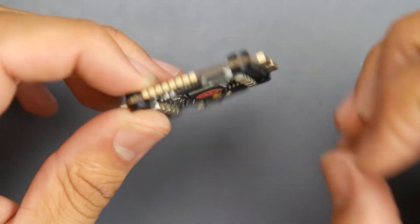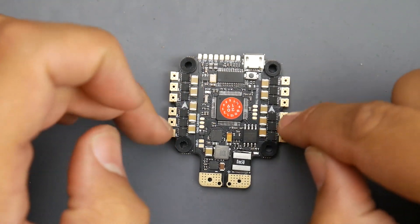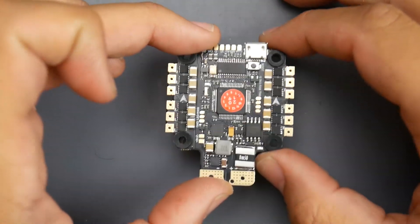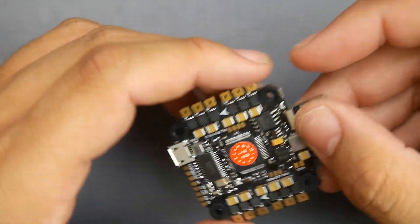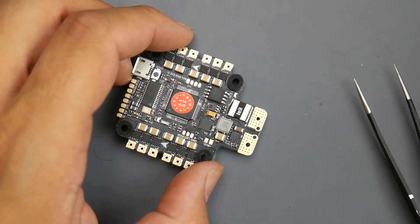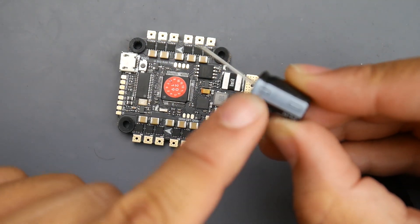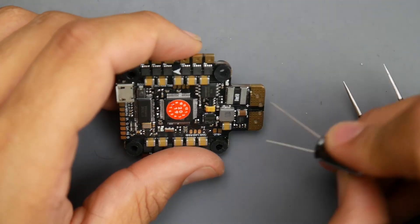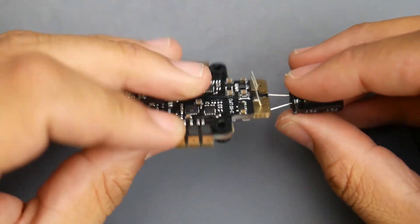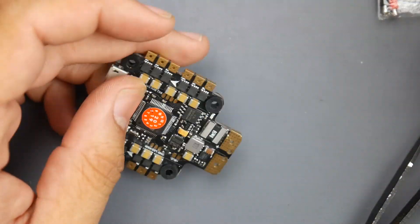It is soft mounted with a pretty stiff mount, which is really good. When the motors are connected directly to the board, vibrations will move down from the motors to the gyro here. So you want as much dampening as possible, because that'll help with the overall tune and flight characteristics of the quad. Something really nice is they also have holes ready for the low ESR capacitor, which is a Rubicon 470 microfarad 35-volt. You would find the ground side, which is the bottom one, and install it like this — add a little bit of solder to hold it in place, then bring in your wires for your XT60.